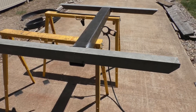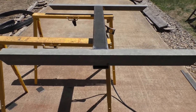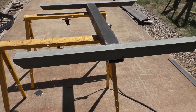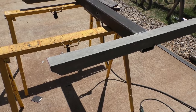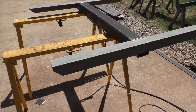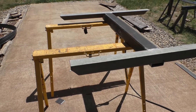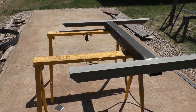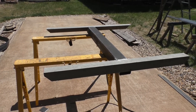After mocking things up I didn't have a lot of confidence in the strength of the middle section, so I've added these two pieces of heavy angle iron to the backbone part. Hopefully that will stiffen up the center of our super strut and it should prevent some flex in it. I think this will be a good addition to things and it doesn't add a huge amount of weight.